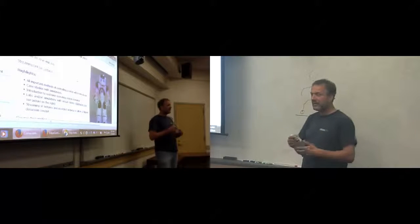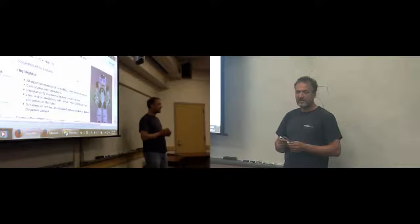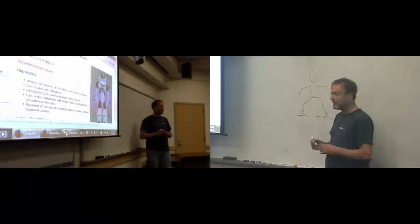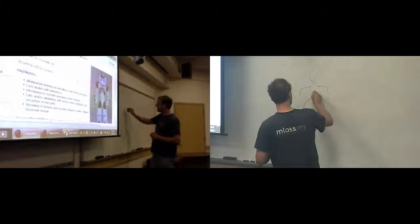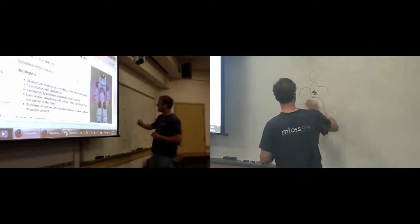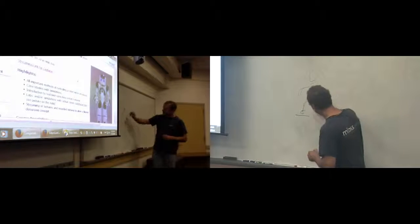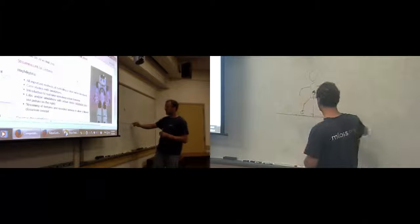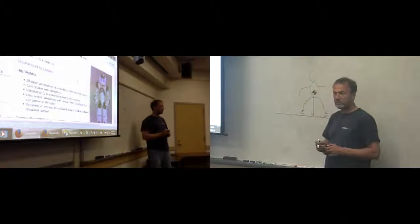So what do you need? And that was actually part of homework number 2. You need to reason a little bit about the center of mass. Since when does a robot actually balance? It's very simple. The center of mass, which is usually shown with this kind of silly circle: if it is between the two feet, if you project it on the horizontal plane on which you're standing, and you put one foot up, you fall over.